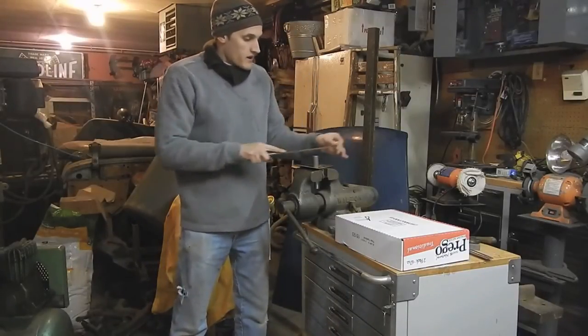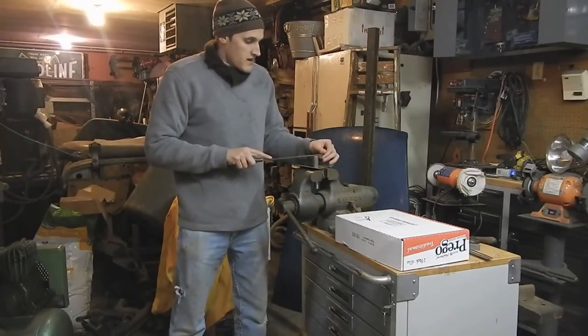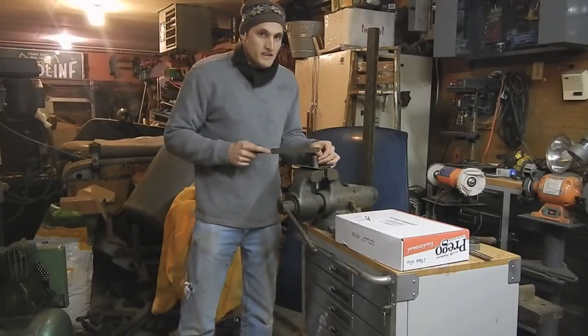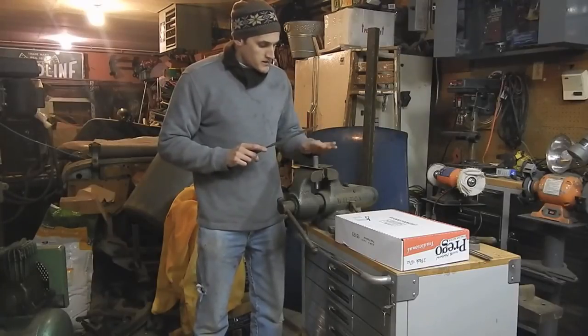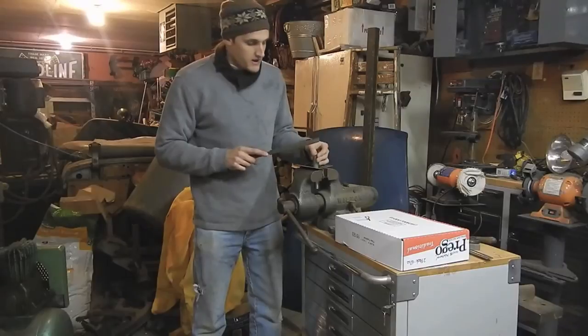You're also going to be listening to it and looking at the pattern that you're creating on the surface. If you hear something like this, then you know you're cutting off an edge, and you'll see a shiny spot on the edge. What you want to see is a nice, even file marks across the surface. You don't want to see it at the edges unless the edges are higher than the center.